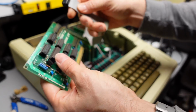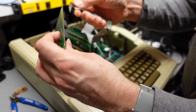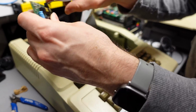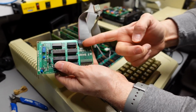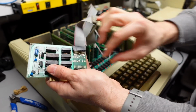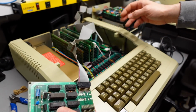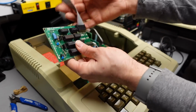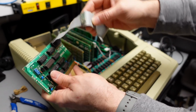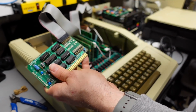And the one thing that I think everyone has warned everyone about is you have to make sure when you connect the cable here that you do not offset any of the pins, either one set of pins over that way or over, because there's 12 volts running through here. And you can definitely send 12 volts directly into the controller card on here, which fries chips. So it's really imperative that this cable always go on the right way and you double check to make sure all of the pins are in the correct position.